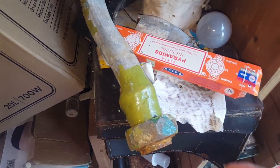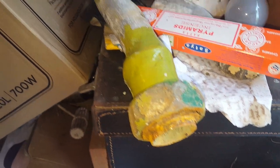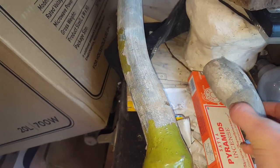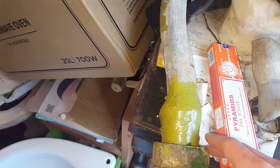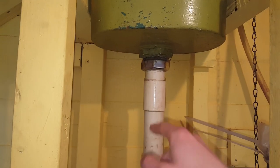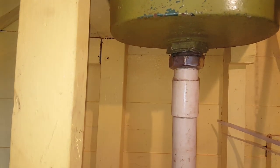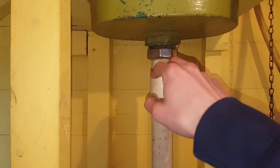This is a good reference point. This is the old flush pipe here — it's a one and three-quarter inch outlet. However, you can see that the pipe narrows down to standard size width, which is typically a one and a quarter outlet. I stuck a 40mm flush pipe on there and it wouldn't flush at all, so I decided to try a little shim, and now it's flushing reliably — as the name says.